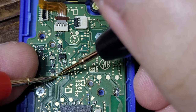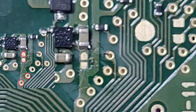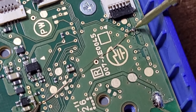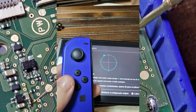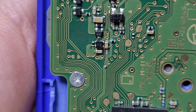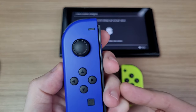On the other side, these three points are on the same line. Here's a closer look with the safe points highlighted, and here are the safe points for soldering on the other side. I solder the wires and check the connections with a multimeter again. Notice that I had a bridge between the two points and the resistor — because of that, the Joy-Con still didn't work properly. So I cleaned the solder and resoldered it to the lower point, and it worked!